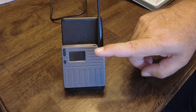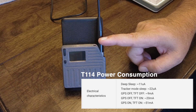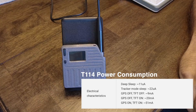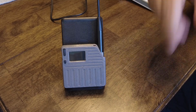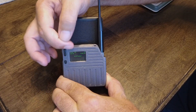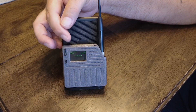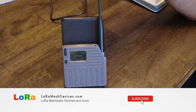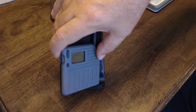It uses like 10 milliamps when the screen's off. I think I have a 2000 milliamp battery in here, which will make it last 150 hours — plus, like a week without having to charge it. So T114 plus the battery, and you can see the two buttons: that's the function button, it comes on, and then the reset button below it. I'll put a link to this case in the description, along with a link to the T114 and the little antenna.